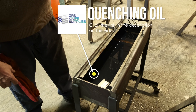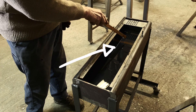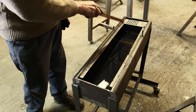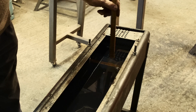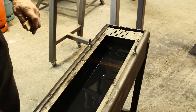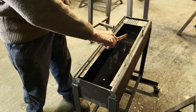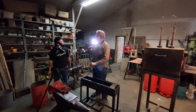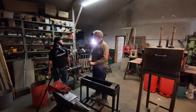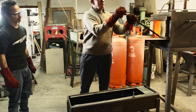Our quench tank's got some high-speed quench oil in, and as you can see there is a piece of bar across the bottom. That is set below the surface. We have our very high-tech depth gauge here, which we can just check to make sure that's down about 20 millimetres. So when the blade is hot and comes out of the furnace, we rest the edge on that bar. That's going to make sure that 20 millimetres gets nice and hard, and the rest of it will cool a little bit more slowly. So we've got him at an angle, squeezed nice and hard at the back here.